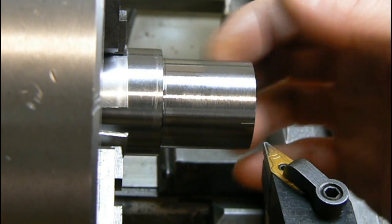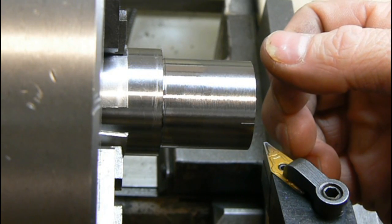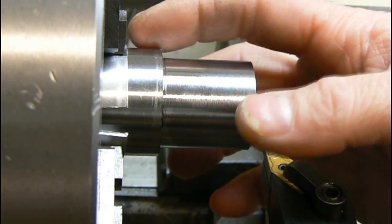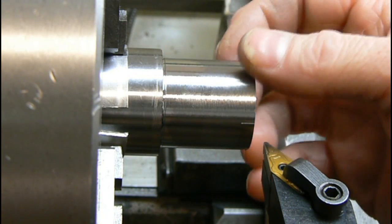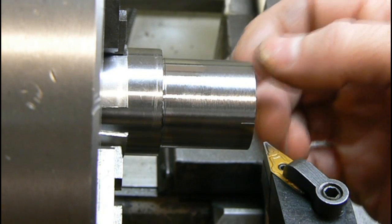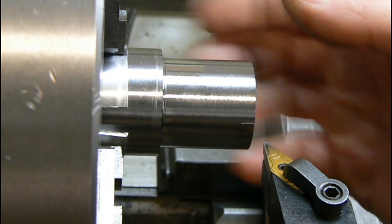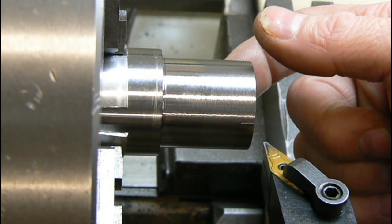What we've got here is a barrel in the lathe, and it's going to be a .375 CheyTac. It originally started at 1.400 inch OD, and we're going to turn this down to an inch and an eighth, 1.125 inches, and thread it for 18 threads per inch. I just started kind of midway in turning the barrel. I didn't think I was going to film this, but I'm going to go ahead and do it anyway.